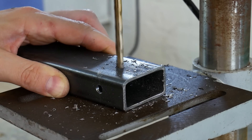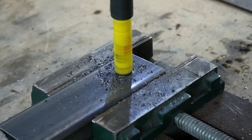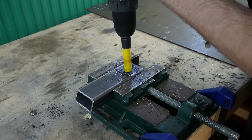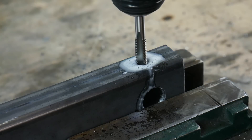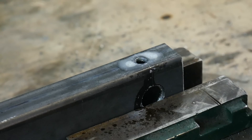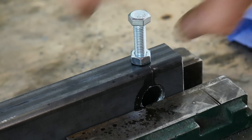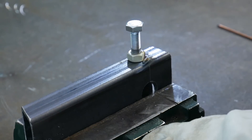I'm going to be using 10-inch hoverboard wheels to drive this for the front and back powered wheels. I'm doing the normal thing here of drilling a big hole which the hoverboard stub can insert through, and then attaching a nut in the other way — just tapping that with a bit of cutting compound. That means we can put an 8mm nut in and weld the nut on essentially, so that we can screw a bolt in — nicely backed up and strong — and that will grip the stub on the hoverboard motor.